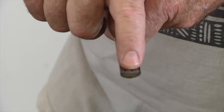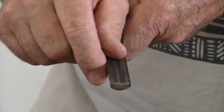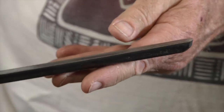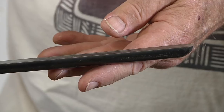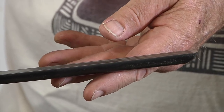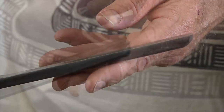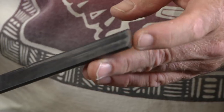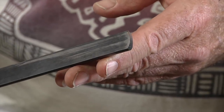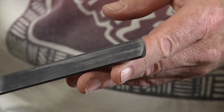This has a rather blunt sweep to it — not very much sweep, doesn't curve very much around to the sides. This is pretty much the way it came from the factory, and if you notice the bevel angle on there, that is about 70 degrees. They come at 60 degrees, but I have all my scrapers sharpened at 70 degrees, so I just keep the platform at that one setting. I've also relieved the bevel, or ground off the heel of it. That just makes it better for going through concave surfaces and going through the transition area and across the bottom of the bowl.